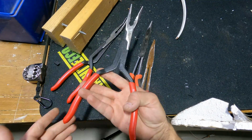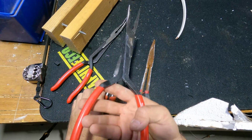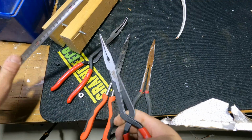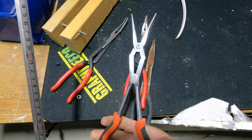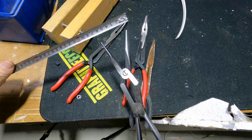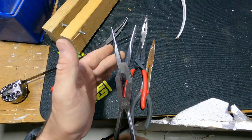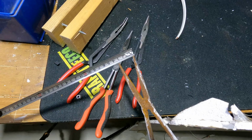And another thing I did notice is that it takes a little bit more to get the width in the head there with your hand. So you can sort of see my max when I'm maxed out is maybe 30 millimeters on those. These ones though, the Crescents, I can open them fully, and they won't open much more. Like, that's really forcing it. So if I open it, compared to the 30, you've got 50. So that mechanism in there is definitely helping, and you can do a lot more with that, a lot more range. It's going to be similar to those ones with these. Yeah, you're looking just under 30 millimeters.